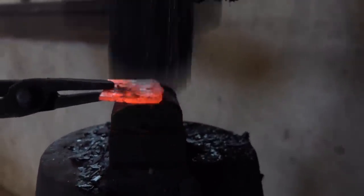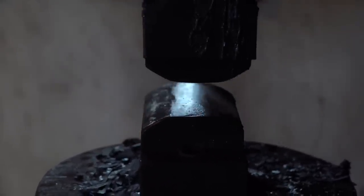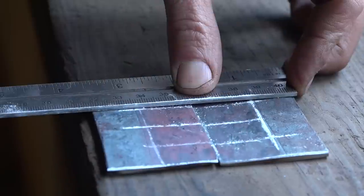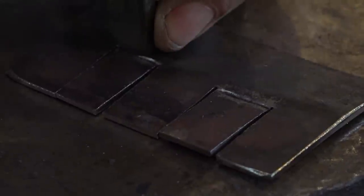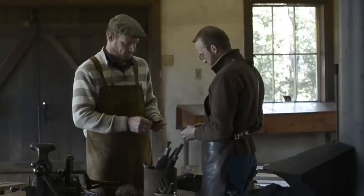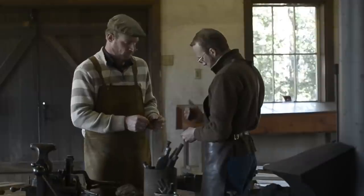Spread it to length. We laid these out together, laid those out into the saw, and cut those, and then with a cold chisel, cut out the waste. So we actually took a cold cutting chisel and chiseled it through. When I think of a chisel, I think of a sharp edge — if I hammer a chisel on metal, the edge is going to be gone. So you must have a special kind of chisel. Yeah, it's what you call a cold chisel — for cutting metal cold. Then we took a file and just filed the shoulders of those, got them all smooth.